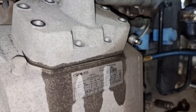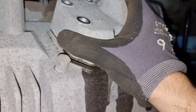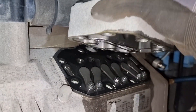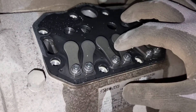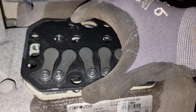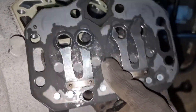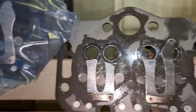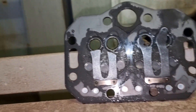Let's open it and see the actual condition of the valve plate. I was hoping the bits didn't fall into the crankcase. This is the LP valve plate of a Star Cool compressor, and the flaps are completely broken. This is the main reason we cannot build up the required pressure. Here's how it looks brand new compared to this completely wrecked old one.